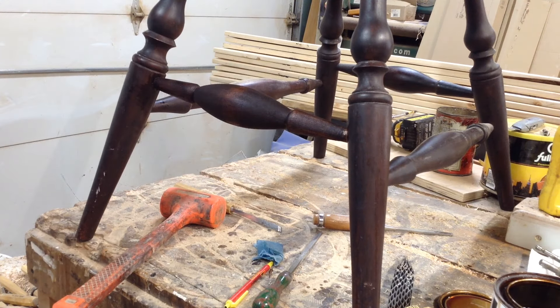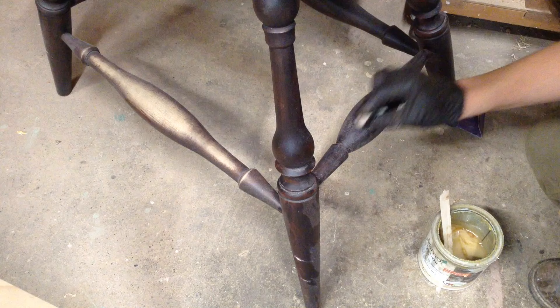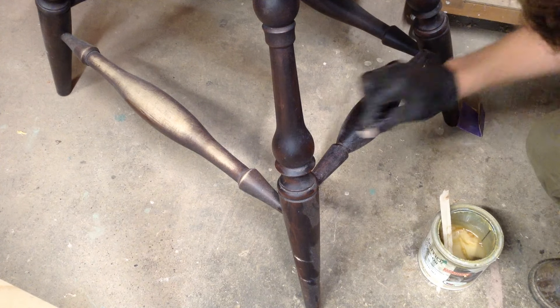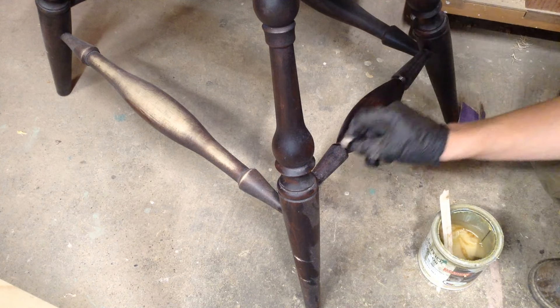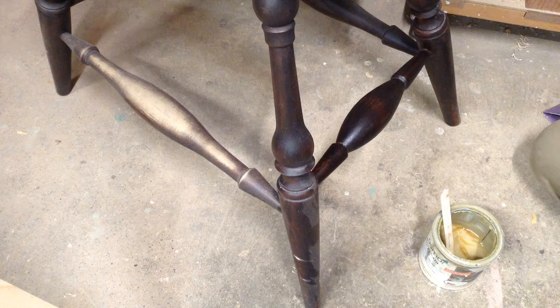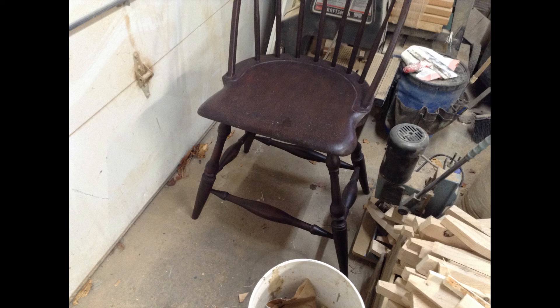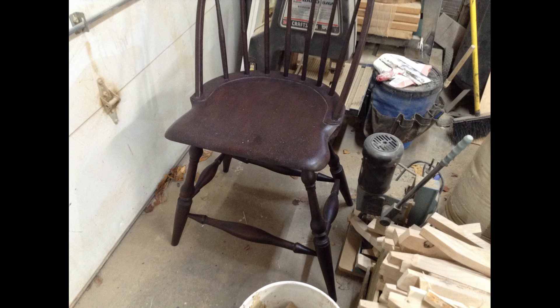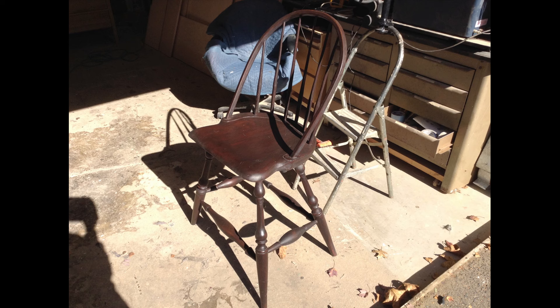For the stain match I just used a pre-stain. I happened to be working on a piece in the shop that was almost the exact same color as this chair. The customer had given me stain — a peppercorn stain from Mohawk stains, which is a nicer grade — and I was able to match it without any mixing. You can see the front of the chair is the worn part I mentioned earlier, which is how I identified the maple. The finish matching was a little difficult at first, but Osmo ended up matching perfectly. They liked it so much they asked me to do touch-ups on the rest of the chair. If you can find a yard sale lathe like I did, it's easy to do repairs like this.